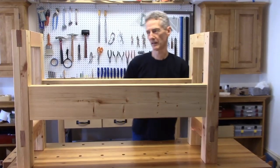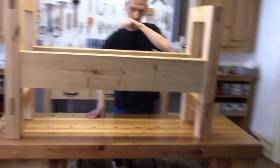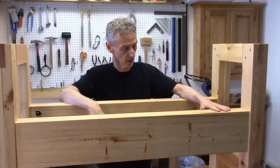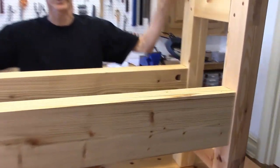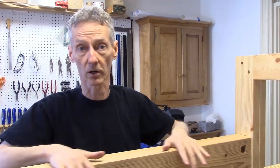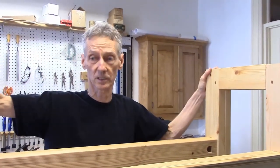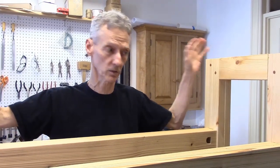It's assembled. It's a workbench on top of a workbench — this is in the same style as the one below it. Now these stretchers — you might be thinking they're a little bit overkill, but you would be wrong. It's very important that they be this big and massive because they really prevent racking. A lot of tables would normally have an apron that goes around here and provides support, but I want that slab top to have nothing that gets in the way of my clamps. So all the support has to occur here. With these massive shoulders on these tenons and mortises, and these bolts that go through providing a tremendous amount of force to clamp it together, this will not rack. It's rock steady — it doesn't move, it's not going to rock.